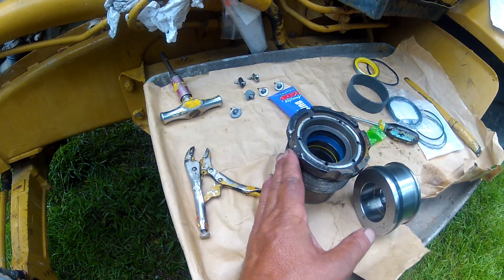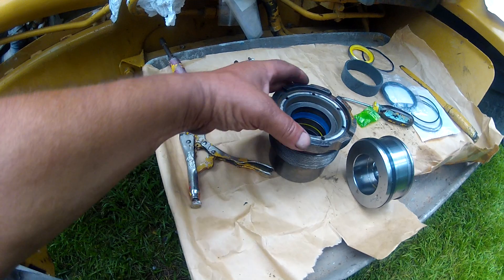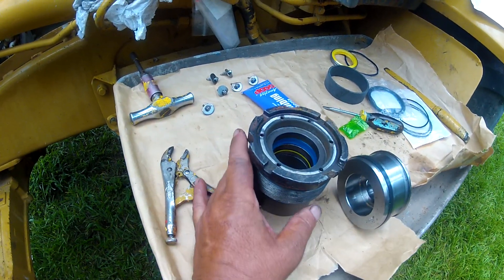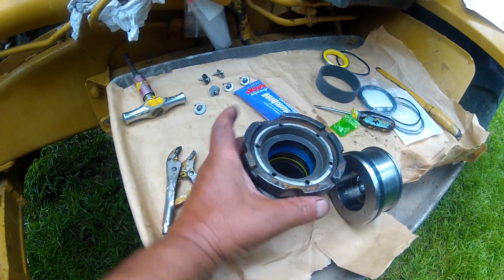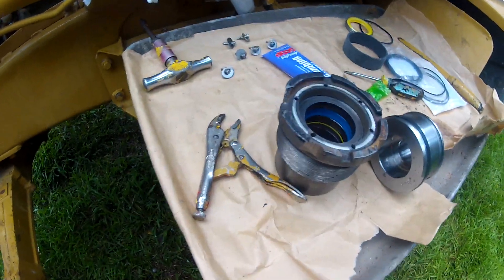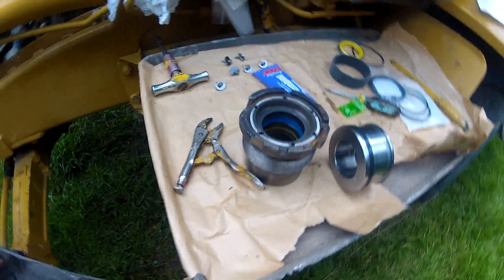I flattened out the sides of the piston rod end cap — with a hacksaw I cut the sides off, and then I notched the other sides, one, two, three, four. I did that so that the wrench would go on to tighten it and take it apart if need be.